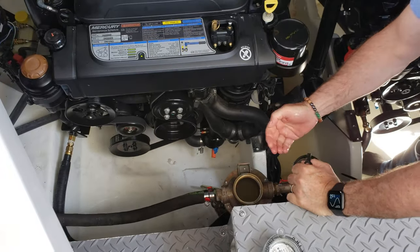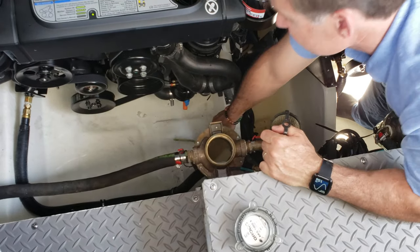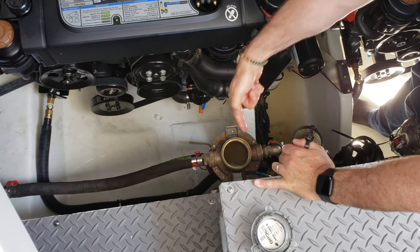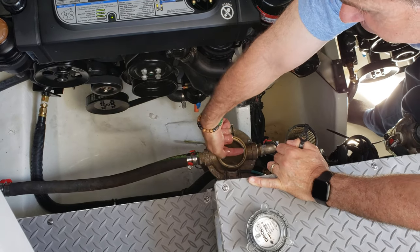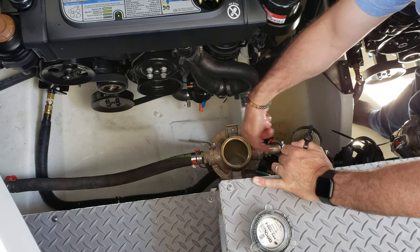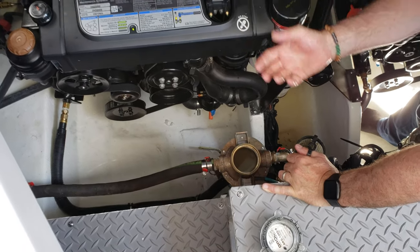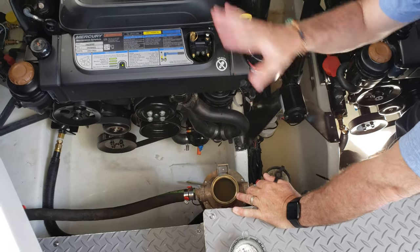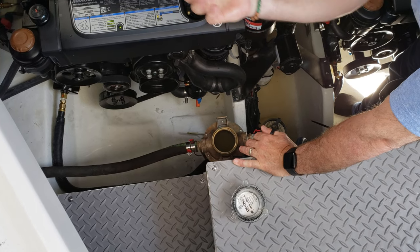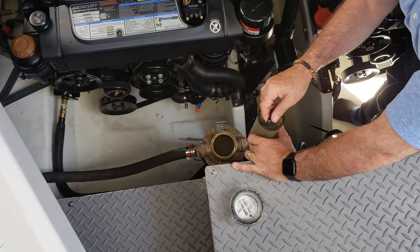If you open up the seacock and no water bubbles out over the top, your clog is stuck between the bottom of your boat and the beginning part of your seacock. That is a little bit more complicated. Two things you can do: you can take your garden hose, open the seacock, put your garden hose in here and squirt as hard as you can to try to back flush the water and release whatever debris is stuck on the bottom of the boat. Or if you're capable and it's safe, go in the water, go swimming, and grab whatever is obstructing that seacock area — or by all means contact your MarineMax location and we'll do the type of service that we need to do.